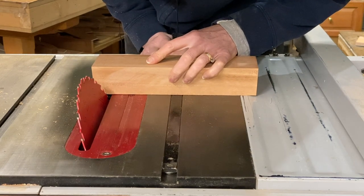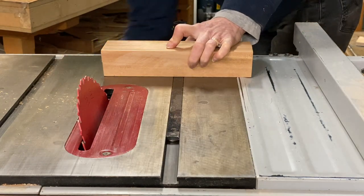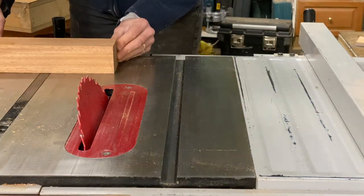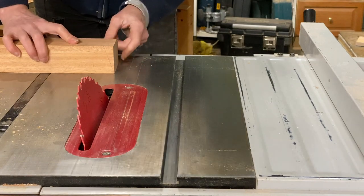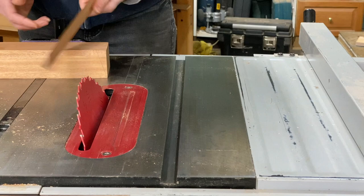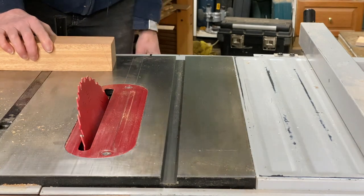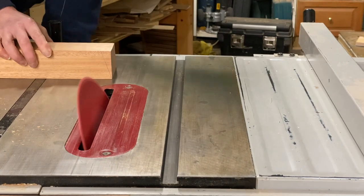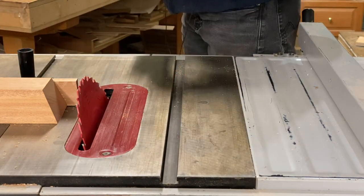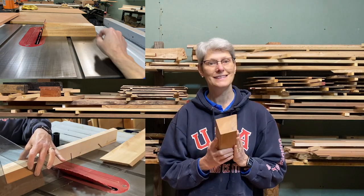It's not enough — I can always make it more. The miter gauge is locked in at 90. I should have done the ends first, because now I don't have a flat side to hold against the miter gauge to cut this angle off. So I'm going to use this extra piece of cutoff as a backer to keep everything square against my miter gauge as I hold it and cut through. And that is one of the reasons why I like a zero clearance plate — I won't get these pieces trapped down in there. This setup block is going to be used in multiple ways to help me set up my table saw to make cuts right and easy without math.